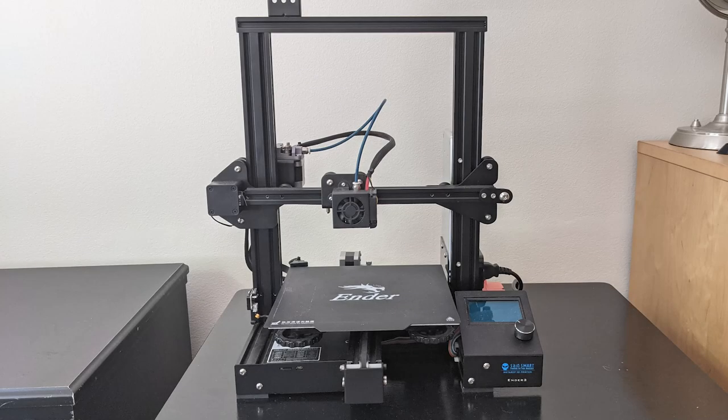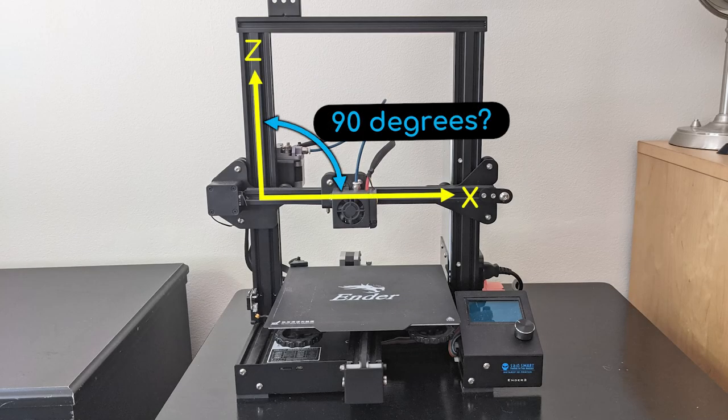Another printing characteristic I had to consider was axis perpendicularity or axis skew. Since the plane is much bigger than my print volume, I had to break up the molds into smaller pieces that I would later glue together. Therefore, skewed axes could cause a fit-up problem.